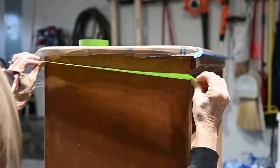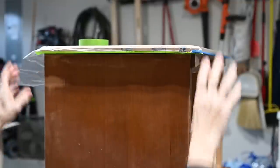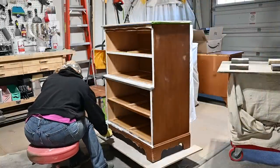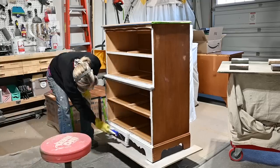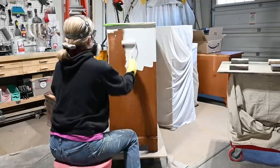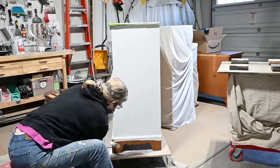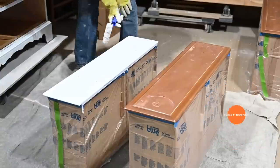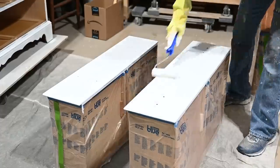You can see that the tape is only on one side when you roll it out, so I got out some frog tape and made sure I cut it long enough on each side to tape it up on both sides. Now I'm using a roller to apply my BIN primer — a shellac-based primer that helps with bleed-through and adhesion so your paint sticks and gives a nice smooth surface. I use a roller with BIN shellac because it is alcohol-based and really hard to clean out of a sprayer.